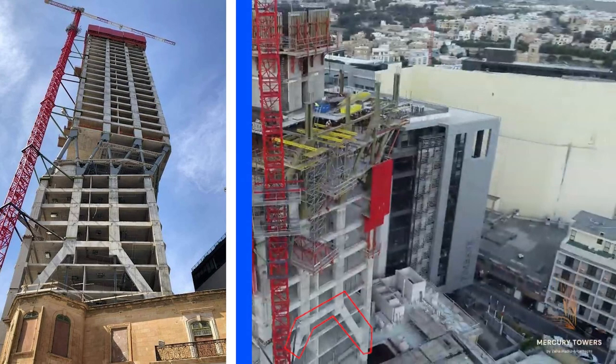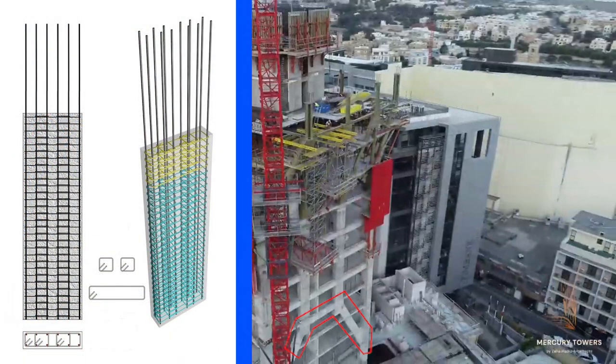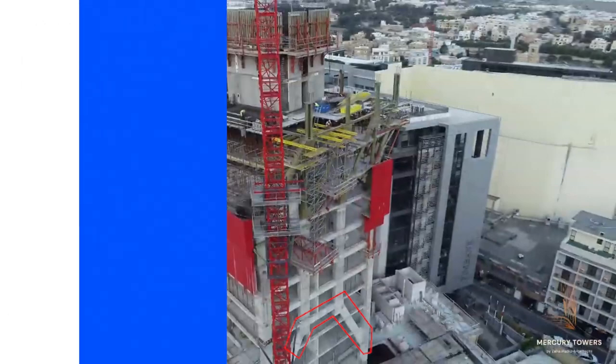For architectural reasons, the two middle concrete columns are executed like braces to transfer their axial force to the corner columns, and they are replaced with two steel columns. The surrounding columns are rectangular concrete columns that act like small shear walls.